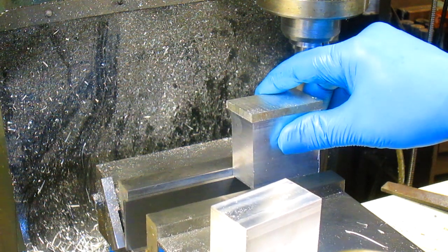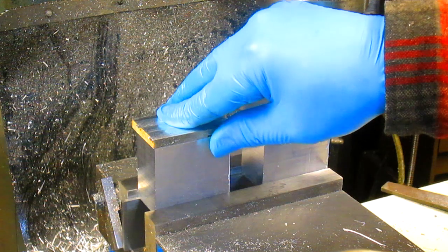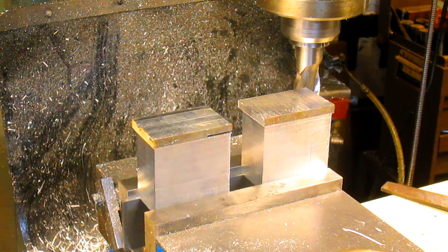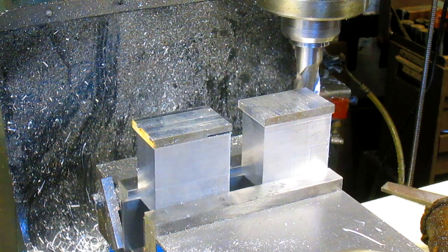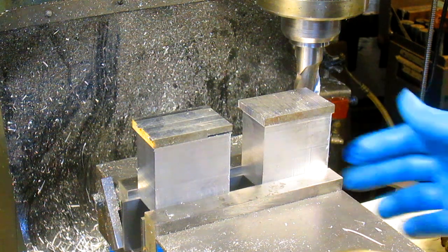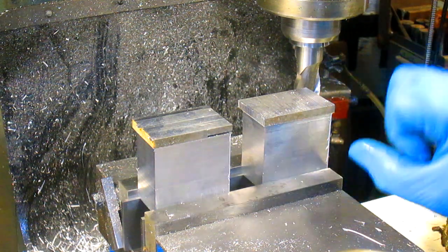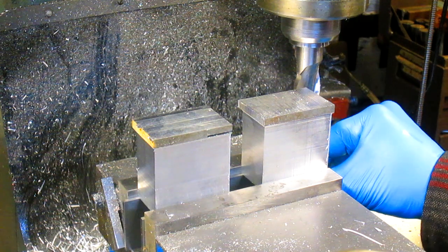and bring the vise in. And we have perfectly parallel surfaces. Okay, jumped up just a little bit. There we go. Nice and tight. Now, for those who don't understand, what I was doing was sliding the parallels in and out until they clamp down, and that way we know we have a totally parallel surface. Looks good.